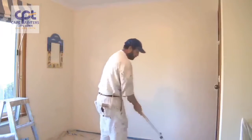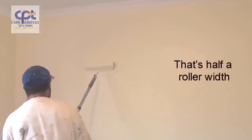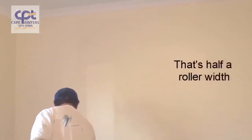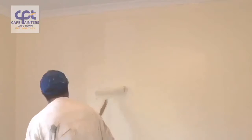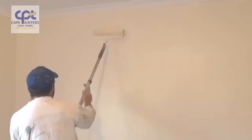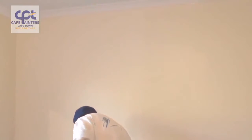That's rolled out, but I'll actually do one more dip. Once again I'll start roughly a roller width away from where I've just rolled. I'll spread the paint out a little bit and then spread the paint back into what I've just rolled. As the paint gets less and less, that's when you can roll right up to the top and right down to the bottom.